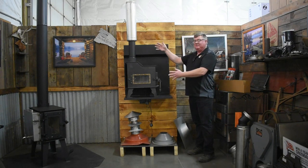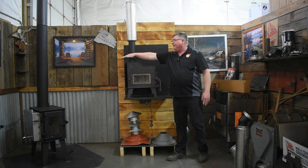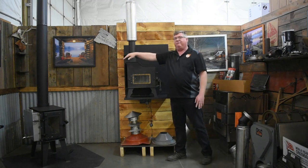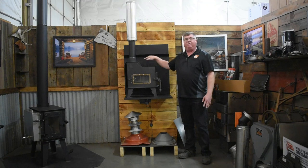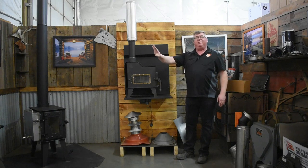If you take this stove and you mount it on the floor on an approved hearth pad, you'll have this built-in heat shield here. Your clearance for combustibles are going to be the same at 12 inches over here, 16 inches here. And if you have a heat shield on your wall with a one inch air gap — so you've got your heat shield, an air gap, and then your wall — so you're not transferring heat right into the wall, you can be within eight inches of your wall at that point.